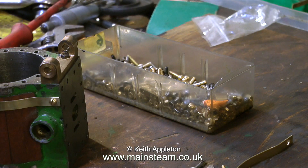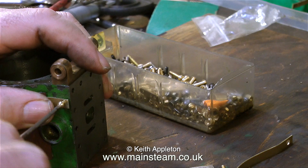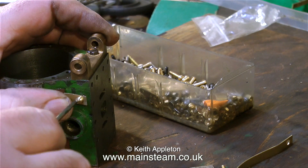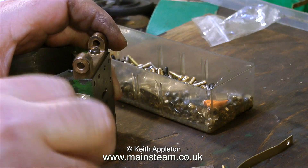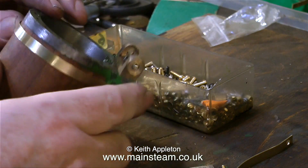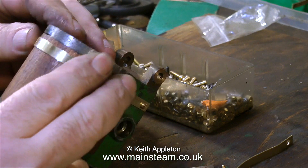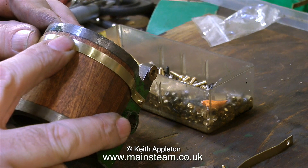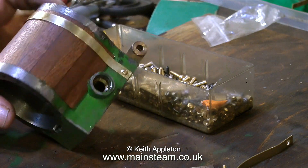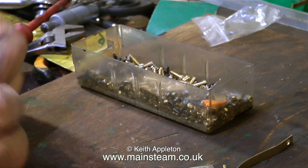It's back to the steam engine — a far more sensible thing to do. As you can see I've put on one of the bands with these very pretty little 6BA bolts. Now I'm removing the bolt so I can bend the boiler band a little bit more — this will hold it tighter to the cylinder. This is not the final fitting; I need to paint the cylinder and give the mahogany another good rub down and some more varnish. I drilled the holes in the banding slightly oversized for 6BA, so there is a little bit of longitudinal adjustment available. This adjustment, plus being able to bend the band wherever needed, plus more varnish on the cylinder, means the band will stick and remain in position.